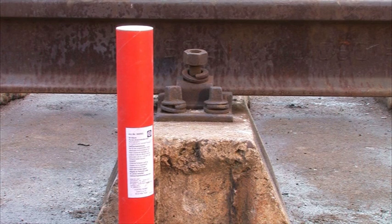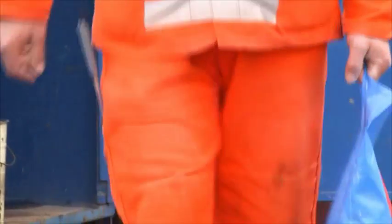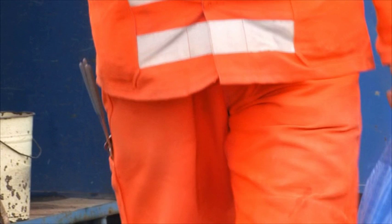At 1000 degrees Celsius, a lighted igniter starts the Thermit reaction. Igniters have to be stored separately from Thermit portions. Don't carry igniters in clothes near your body.